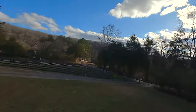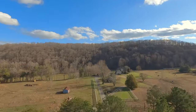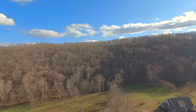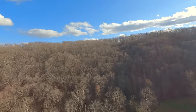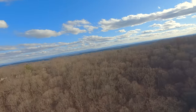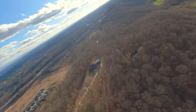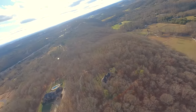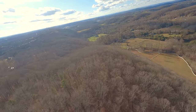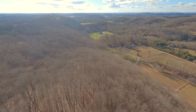So we're going to start this flight test with a demonstration of the kind of thing that a seven and a half inch class quadcopter is good at, and that is smooth cruising. The first thing I'm going to do is fly straight without moving the throttle, and I'm going to raise the throttle slowly, and we can look for vibrations at any throttle position. There's full throttle, and we'll come back down again. And I wasn't moving the sticks at all through any of that. So any vibration that we see, we know is because of the motors or the frame design. And of course, if it's smooth, then that's a good indication of the quality of this quad.